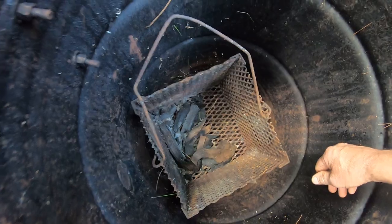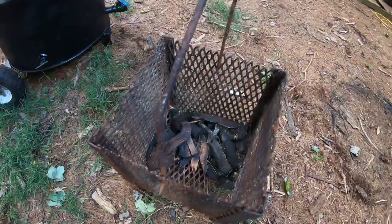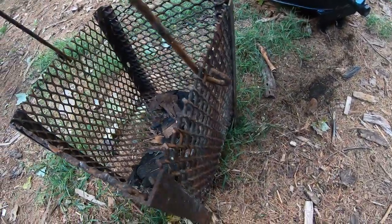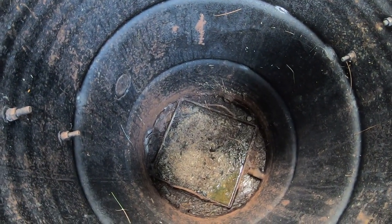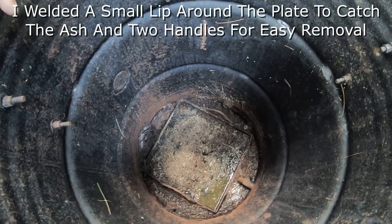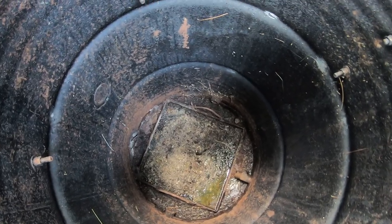Inside I've created a firebox. It's expanded metal with thin angle iron on each leg and expanded metal in the bottom, tack welded together. I made a handle so I can pull it out easily, and the handle folds down out of the way of the grills. Inside I made a heavier plate to catch ash, so nothing falls directly on the bottom of the drum. I drilled a couple quarter-inch holes in the bottom so any collected rain can drain out.